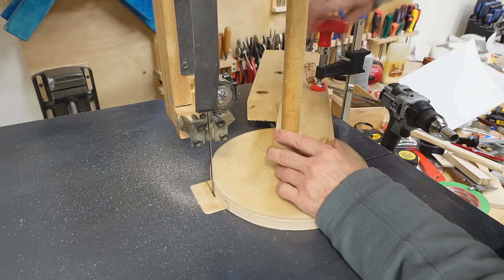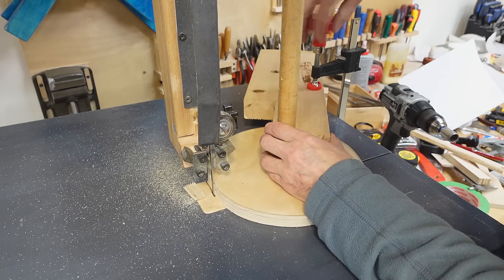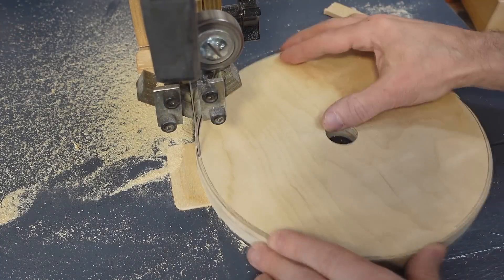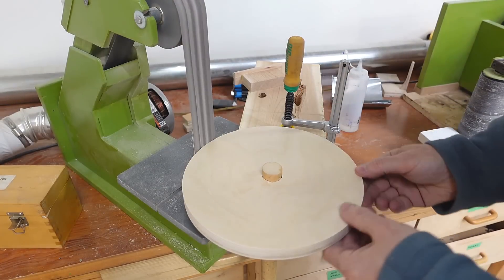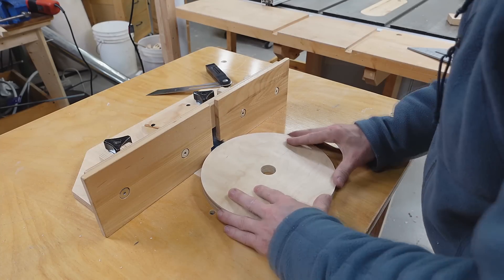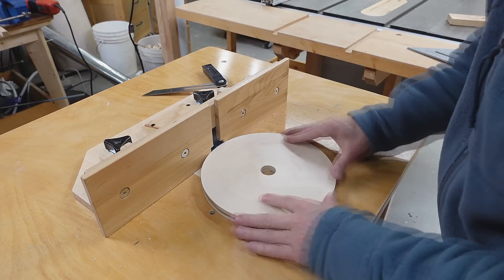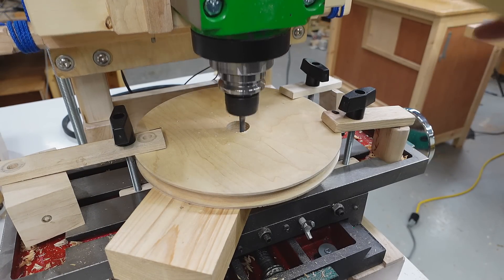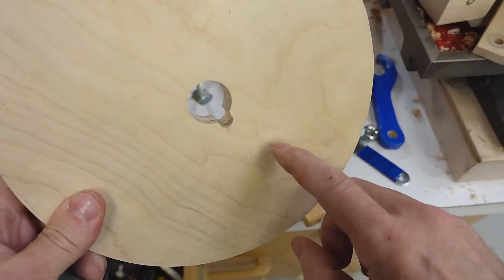To get the circle for this pulley perfectly round, I thought I'd set up a circle cutting jig on the bandsaw using the hub hole in the middle. But my tracking was off — I adjusted it several times but the blade just kept going where it wanted to. It was not a success. So I was left cleaning up that mess with a freehand cut, then further cleanup with my strip sander, and finally using a jig in the strip sander to get it perfectly round. Then onto my router table with the tilting router lift, with a slot cutting bit tilted 20 degrees and cutting from both sides, making a nice V right in the middle of the pulley. I still needed to cut a keyway — last time I used a jigsaw, but here I'm drilling it out with a router bit, inching it over one bit at a time.